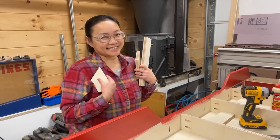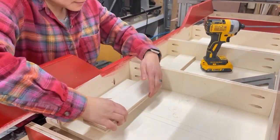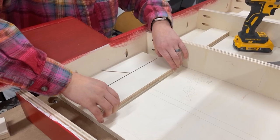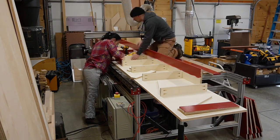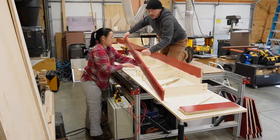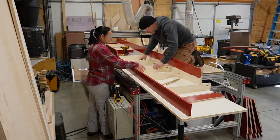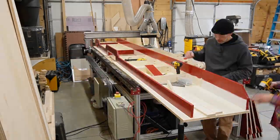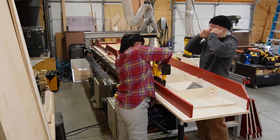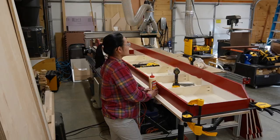At this point we also added thin strips of plywood to the underside of the top to give us more material to screw into when we recess for the t-tracks in the future. We used scraps as a spacer to keep the strips a consistent distance from the front, then applied a bit of glue and drove in brad nails to clamp things while the glue set. After a while we got into a groove, alternating between gluing and screwing a rib and gluing and nailing a t-track backer. Since the box was hanging off the end of our table, we fine-tuned the height of a roller stand to support it and used clamps to keep the top tight against the front and back rails. We wrapped up this part of the frame by attaching the last piece of the back and the left side.